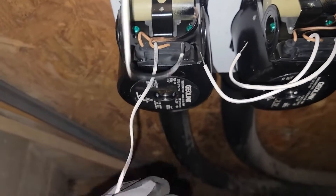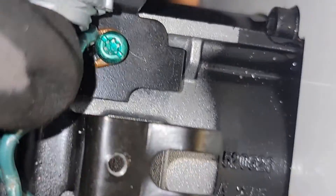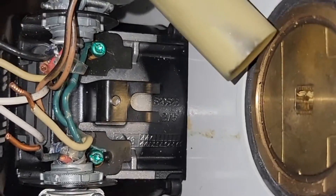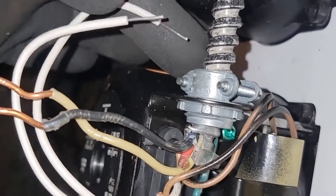You can see there are two power wires for each pump — L1 and L2 and then a ground — providing 230 volts. To get the ground screw and ground wire connected properly, I move the capacitor out of the way temporarily so I have more room to work. Using ring terminals for your ground wire connection is really easy and a good way to make sure your ground wire is connected properly. Now I can put the capacitor back in its spot and wire everything up. Make sure the half-inch Romex connectors are nice and tight.